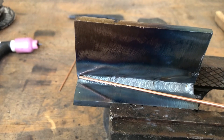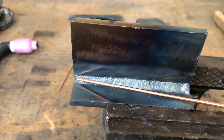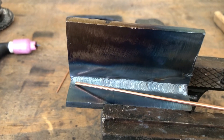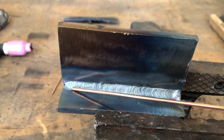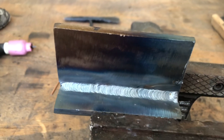Now I'm going to put a layer on top of it. You want to feed your wire a little above the middle — feed it towards the top — because as you come down, gravity is going to pull it down and it's going to look like it's sagging if you feed it in the middle or toward the bottom. So I prefer to feed mine toward the top a little bit and drag it down.